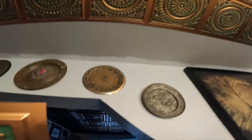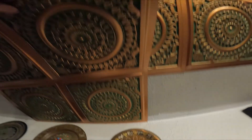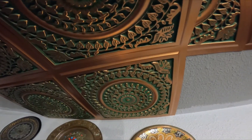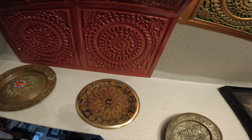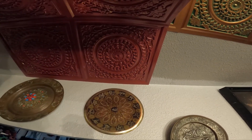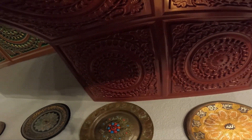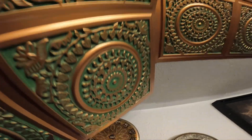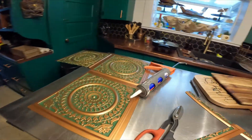You have to think about everything upside down and backwards. The way this tile would fit here, it would sit like this — but this is not the part that gets glued to the ceiling. You want the clean edge out and the cut edge against the wall. So what I do is flip it 180 degrees: this straight edge turns over. You wouldn't want to cut it the wrong way or everything's flipped and you'll end up too short on one side. I make little markings and then cut.